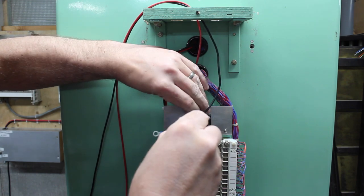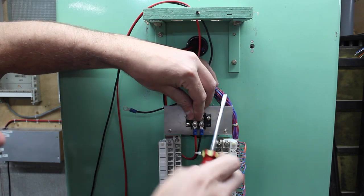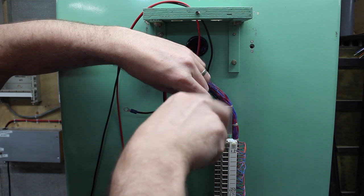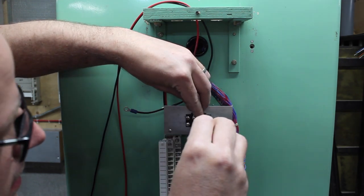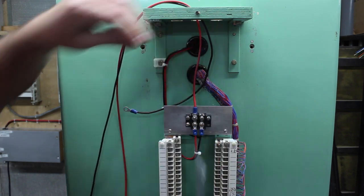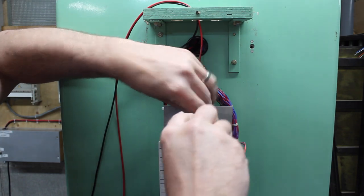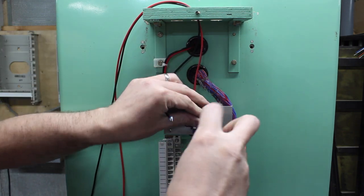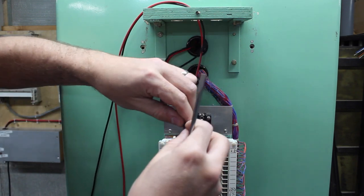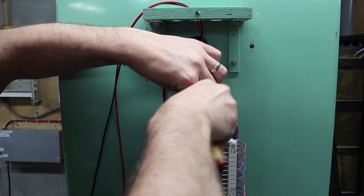I think there's some kind of telco color code for wiring. Blue and white, I think. But I did red and black just to stop me from making really stupid mistakes and wrecking things. Although the most sensitive piece of equipment is probably the channel bank, and I've already managed to attempt to reverse the polarity on that, and luckily the guys at Adtran foresaw my stupidity and put some protection diodes on there, which is handy.